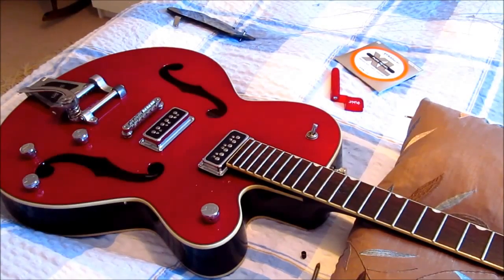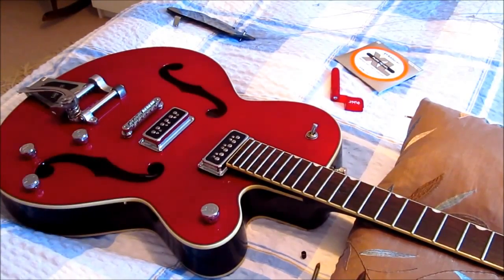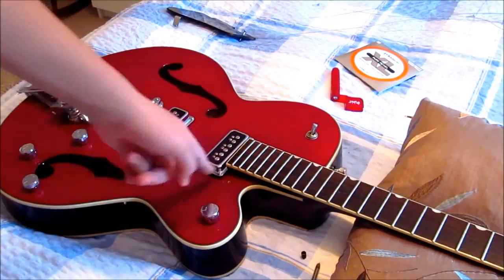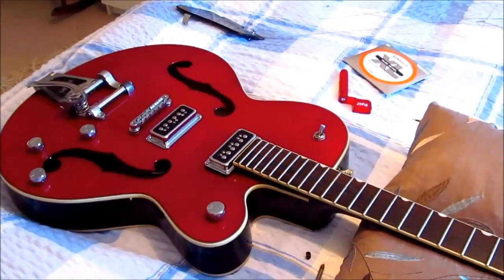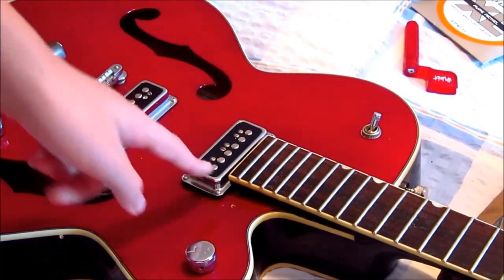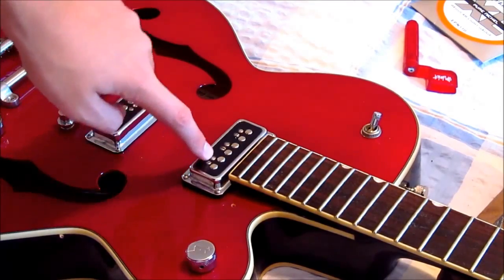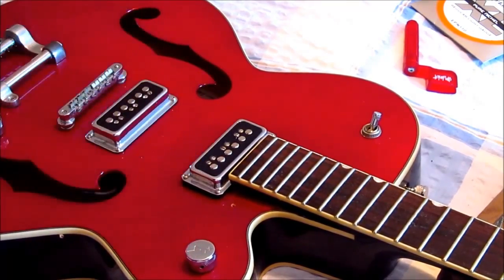So you might think that this guitar is a dual coil pickup guitar. So I'll zoom in while the polish is taking place. I think the big one is the pickup, and the pole piece, it's called, as it looks like the pole when you take it out. And this part here, 2, 2, and 2, they are actually screws, so you can adjust the height of the pole piece. When you screw it, it'll go high, and you screw it the other way, it'll go down.